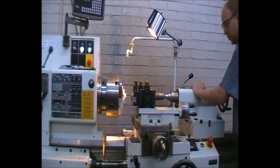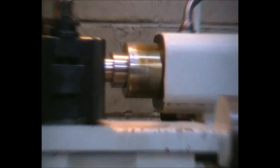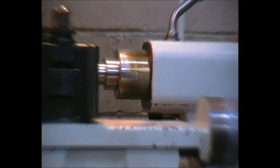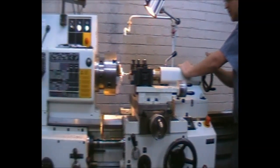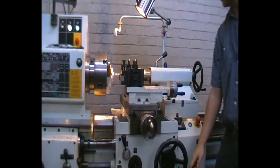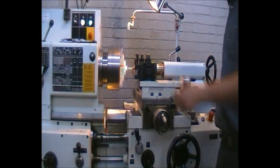Also move into position. As can be seen, there are markings to indicate the depth which we want to drill if we desire a certain depth. Please note though that the tip of the drilling bit is at 118 degrees and will not give you a square edge. We clamp it into position again and then by peck drilling, we will drill a certain depth with coolant.